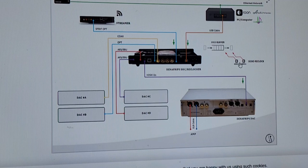So if you keep your DAC on all the time, like what I do, okay, this is rendered moot because it doesn't need to warm up. It's always at an even temperature. You have a nice sealed box. You have it on all the time, so it stays at a steady temperature. So this is not so important. These are important if you have them in environments where the outside environment changes temperature, and you are concerned that inside here you need to keep it at a steady temperature. So yeah, it's a higher thing. But as I mentioned to you before, crystal oscillators are old school technology, okay? So they're still using crystal oscillators. They probably have 10 million of the damn things that they made there, and they need to sell them, okay?